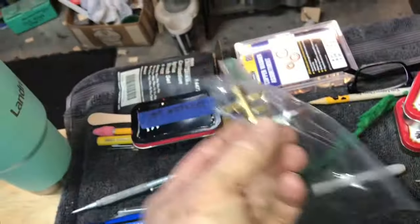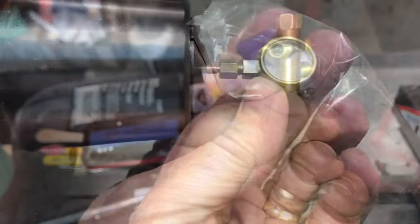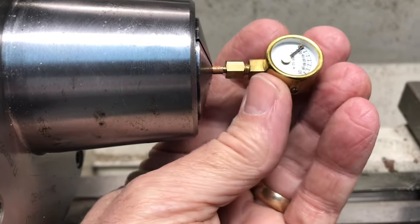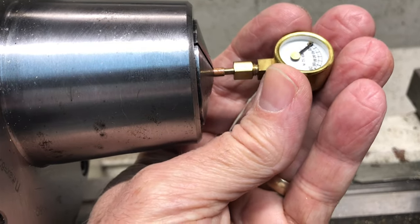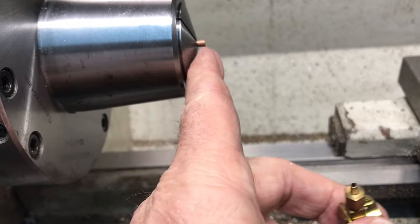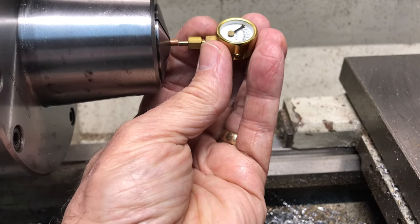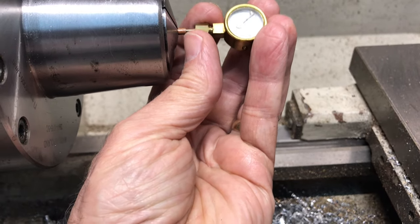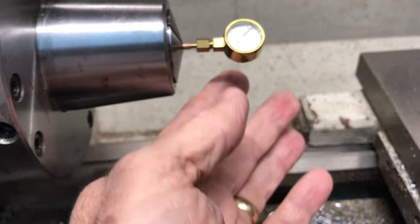The next thing I've got to figure out is the connections from the steam header and whistle valve to the pressure gauge — I'll be working on that tomorrow. The PM Research pressure gauge has a stem that is three thirty-seconds of an inch. I've got a bunch of eighth inch copper, pretty much thick wall tube, that I'd like to use for my connection to the manifold. What I did: I straightened out the tube, prepared the end, and drilled and reamed it a little bit oversized so now it'll fit the three thirty-seconds inch tube. My thought is to silver solder the little stub tube that comes with the pressure gauge and then use the eighth inch tube how I see fit.